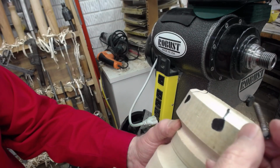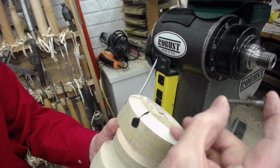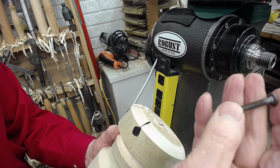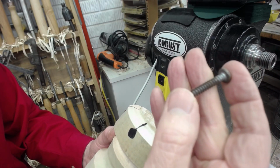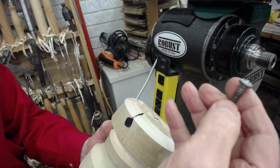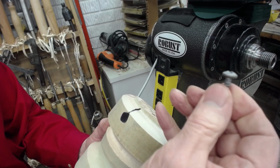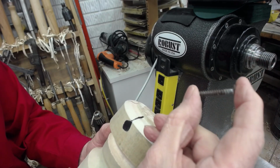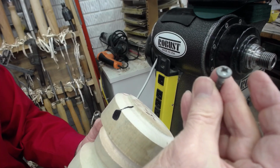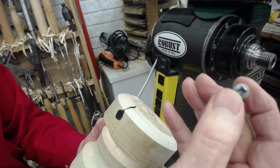And one of the other things that is important, that you use good screws, the good sheet metal screws, pan head number 12 sheet metal screws gives you the best strength. Wood screws aren't a good way to hold wood. These threads are sharper and tighter and will hold better in end grain or side grain. Okay? Only need 1.25 inches long, but you need to have a good straight-sided screw. I use a number 12 because the number 12 has a number 3 Phillips.